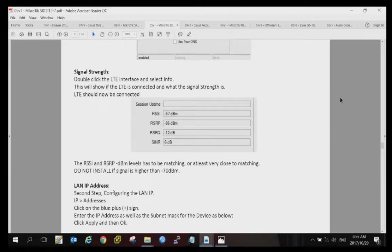Alignment. Okay, because we're monitoring signal here, and the only way you can change signal is alignment. Well, for the RSSI, the lower the number, the better it is. Yes, closest to zero. We've had sites like that. Their company has seen it as well before. I'm not sure who picked it up at your company, but we've seen it at other sites.